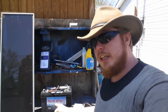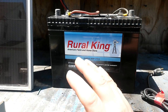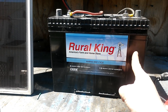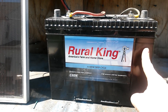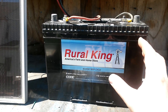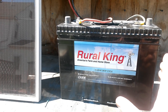The third thing you're going to need is a battery. There are literally hundreds of different styles of batteries. This one here is a typical farm battery — I bought it for about 70 bucks. It's 105 amp hours and it's a deep cycle battery. In solar applications it's best to go with deep cycle batteries, but on a system this small you can use a car battery, a moped battery, or almost anything you can find.